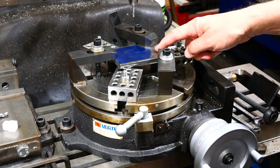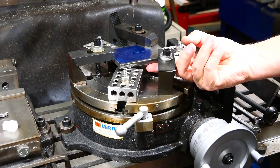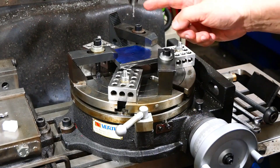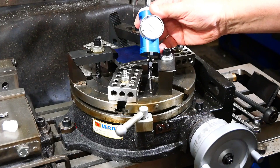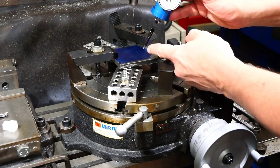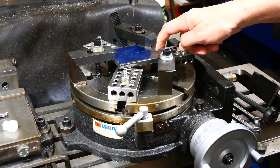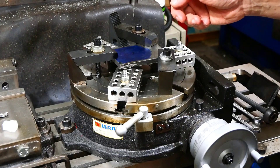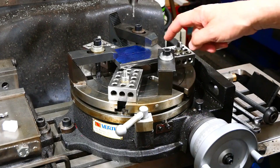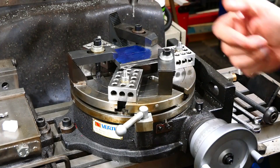I've moved over to the milling machine. My piece of work is set up on the rotary table, sitting on 1-2-3 blocks so there's room for the cutter to come out underneath. I centered the rotary table under the spindle using the centering indicator, then used it again with its point on the intersection of my scribe lines to center the piece under the spindle. Now when I rotate the table, the piece rotates around the center of the hexagon.